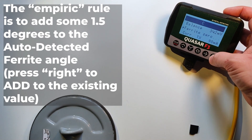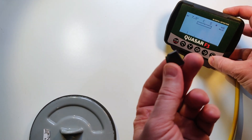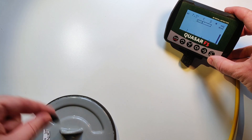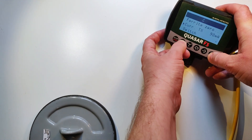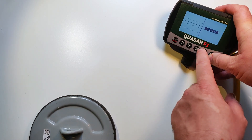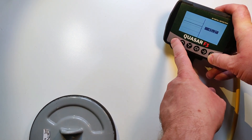Let's save it and go for a test. Our task is that the coil should not see this ferrite specimen, but I know from experience it will see it right in the last sector. It sees it in the last sector, so we need to correct the ferrite. We go back to ferrite zero and apply a correction of about 1.5 degrees — so 43.2 will be right.